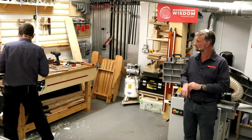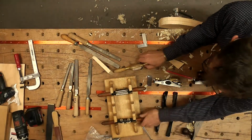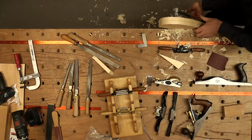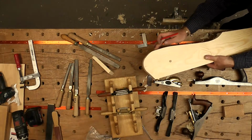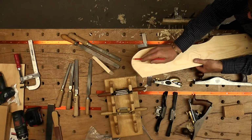We've got our long curve to do around the front. So I turned it around the vise. I want flat spokeshave again. Longest point I can come up to is where those fibres get longer. So let's just flip him out. It's coming around here. I think we can see. Let's have a quick, yep. Okay, so we're coming around. Got this curve to cut.